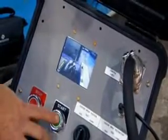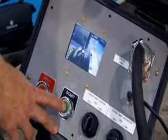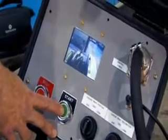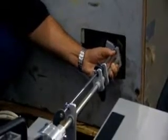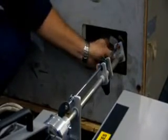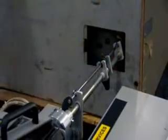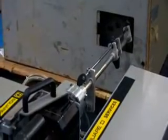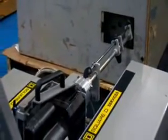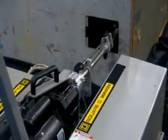To rack a breaker into the cell with this type of system, with the circuit breaker in the open position and springs discharged, the circuit breaker is rolled into the breaker cell. The racking cart drive shaft socket is connected to the circuit breaker levering shaft. The racking cart shaft socket elevation is adjustable to account for varying switchgear mounting pad heights. Alignment of the drive shaft is checked and the racking cart is positioned so that the drive shaft is at a right angle to the face of the circuit breaker.